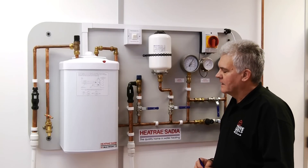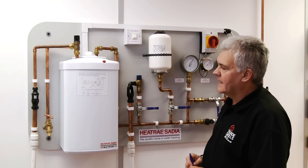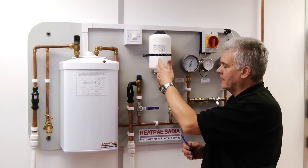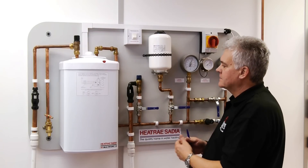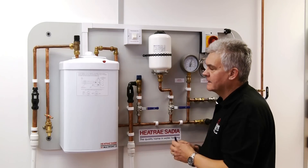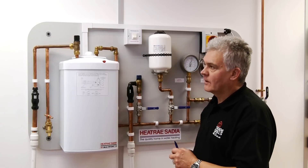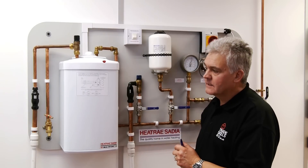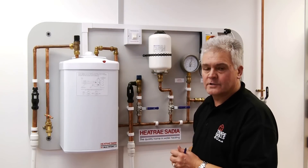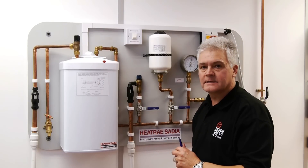The last thing I'm going to show you is our last line of defense. If I bypass the thermostat, the temperature will continue to rise. Remember, we've got no expansion relief here at all, no expansion vessel — we've taken those both out of the system. The temperature will start to rise with no pressure relief either. When it reaches approximately 90 to 95 degrees C — on our rig here it's about 90 degrees C — the temperature and pressure relief valve opens, but this time on temperature, and will start to discharge full bore, enabling cold water to come rushing in to cool the system down and maintain a safe condition.